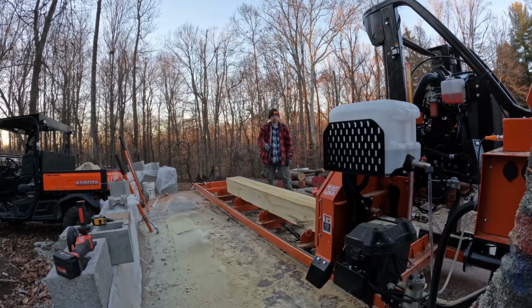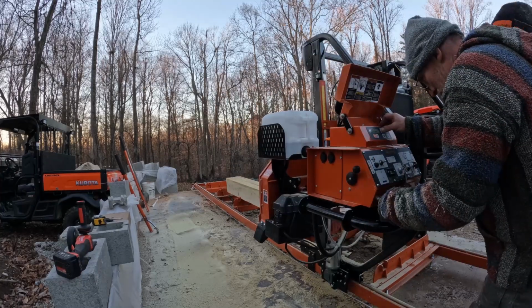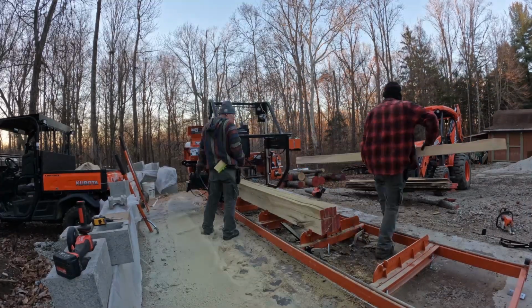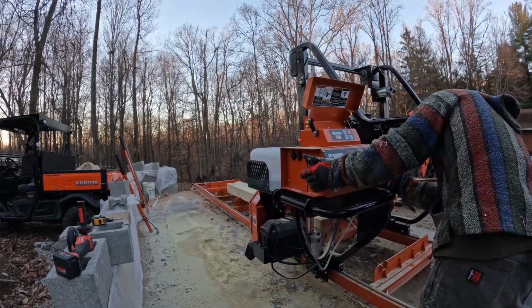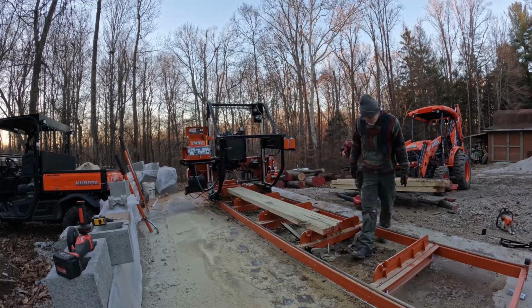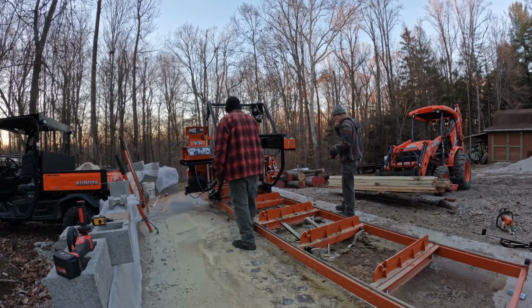Okay, so here's a look from the outside of cutting those 2x4s. So again, it will utilize the simple set here. Get it set, have it go down the 3.5 plus the 1/8. Get those boards ripped, put them off to the side, and then just hit the down button again to produce the same cut. And then that left some 1x1s or 2x2s at the bottom that we can use for something else later on.